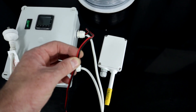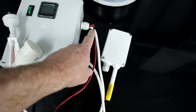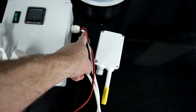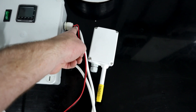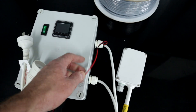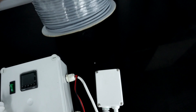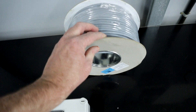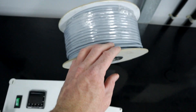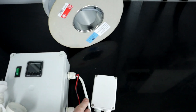I'm going to replace this old cable. This is some speaker cable I was using at the time for my CO2 sensor, but it doesn't actually work that well. It's getting heaps of interference — even running past the power cable here causes the voltage to spike up and down, giving a really poor signal.